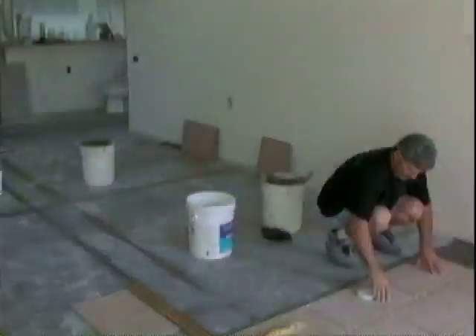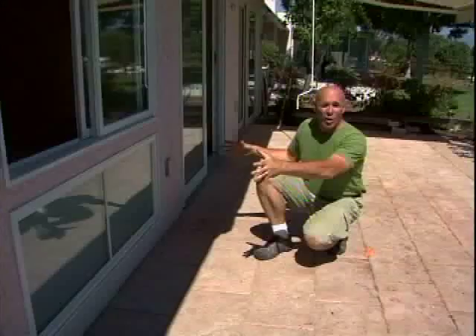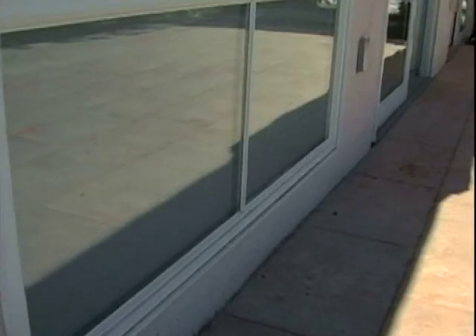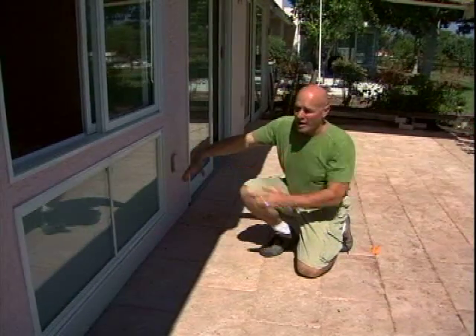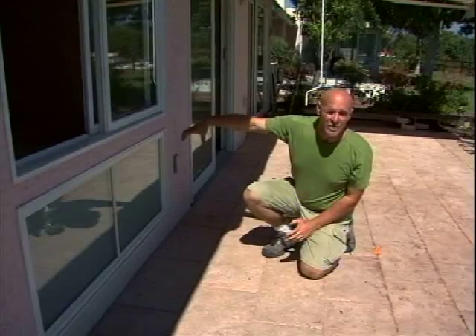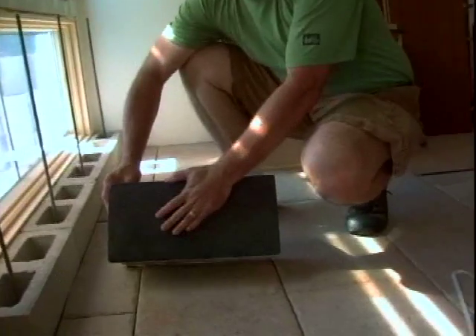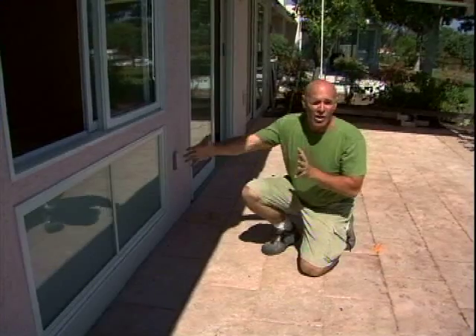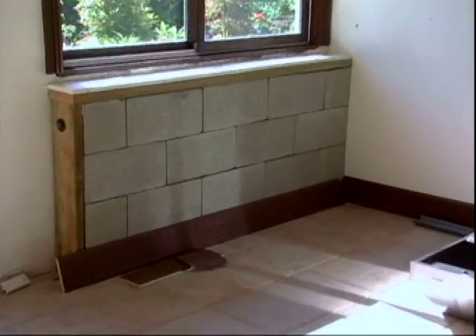While the tile is being laid, Chris decides to put a passive solar collector called the Trombe wall in his living room. This window is being used as a heater in wintertime. When the sun's low in winter, it's going to shine through that window and warm this big block wall on the inside. All of these blocks will get stacked on here, and they're pre-painted with a flat black paint that will soak up the heat better than just the gray. Then all night long, that heat goes back into the house — so it's a little passive heater for the house in wintertime.